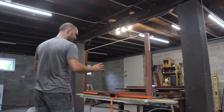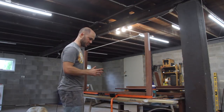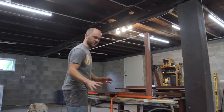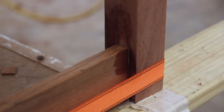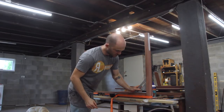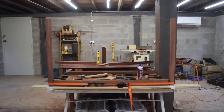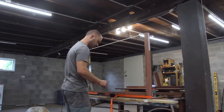So there was a bit of chaos after I'd put those two clamps on — basically they weren't working, it just wasn't enough. So I ended up getting a ratchet strap to pull these two legs in because there was a gap on this joint that was just too big and I wasn't able to squeeze it out. This ratchet strap is pulling the two legs into the rail, and now we're at about half a millimeter and maybe a millimeter on that end, which is a tolerance I'm more than happy with. So now we've just got to do it all over again.